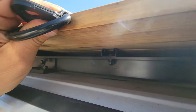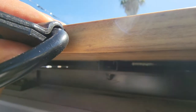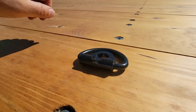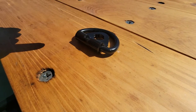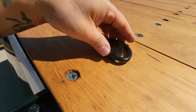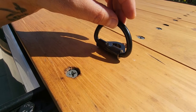If you hold this in place here, flush with the top, you should be able to see some decking under it. There's going to be about a quarter inch of wood still under this thing. The idea is this will go into one of the screw holes, I'll trace it with a pencil, get a router up here with a straight cutting bit, remove that material, and one of the bolts will go right through here — through the deck board, holding it down right into the unistrut. These will be super tough lashing points.